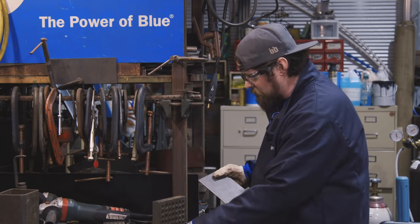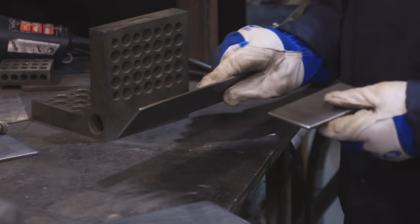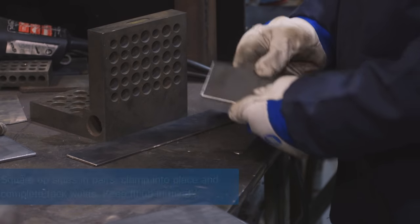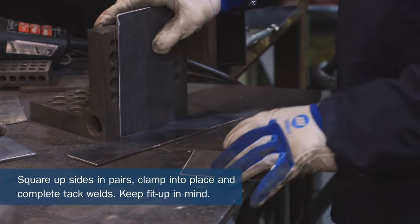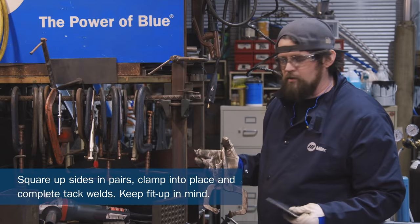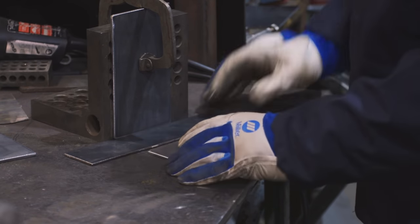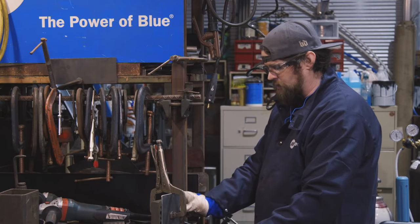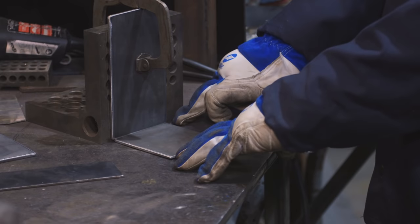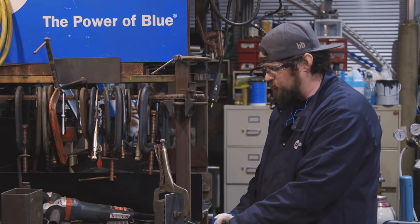So this material is about 5/32nds — I'm going to use a piece that's about an eighth of an inch. In the end I'm going to have about a 16th of an inch of overlap to protect the backside of the weld. I'm going to use my quick clamp and use the eighth-inch piece to set the height, clamp it up, and then my machinist square is going to keep it at 90 degrees. Then I'll tack it in place and continue for the other three sides.